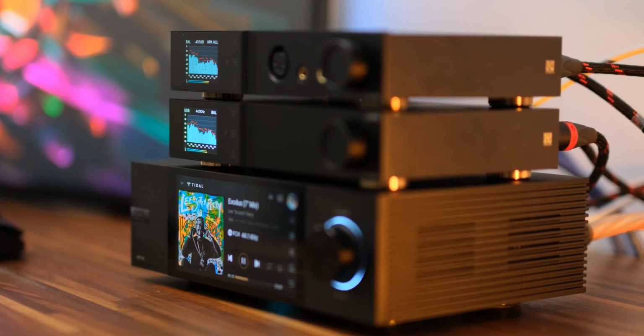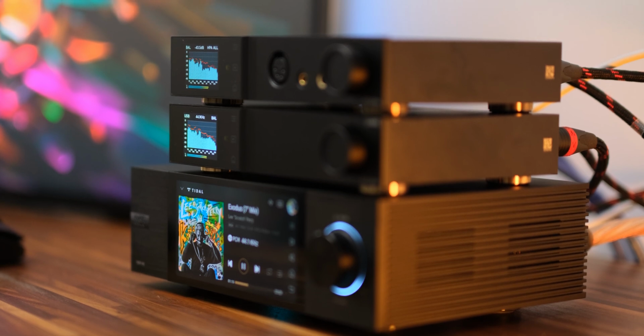Topping also replaced that oversimplified volume control with a much higher precision R2R volume control by using ladders of resistors and a few analog relays for a perfect channel balance between left and right, using it as both a headphone amplifier or as a preamplifier.